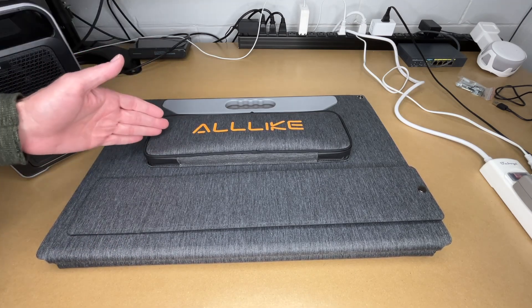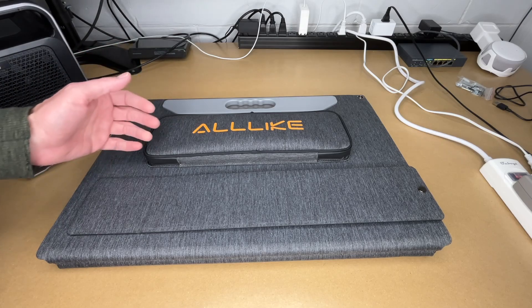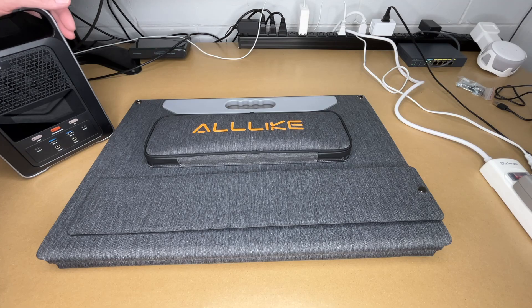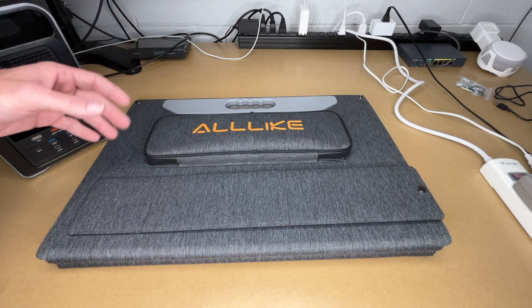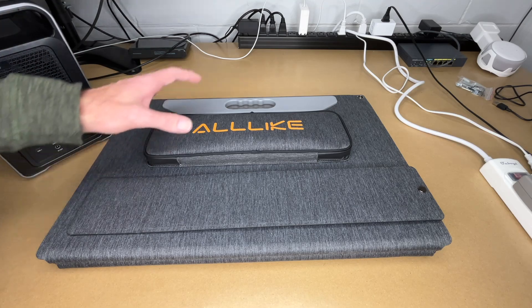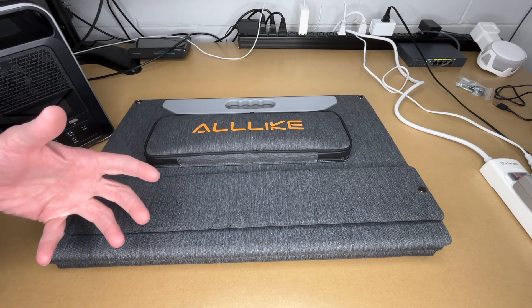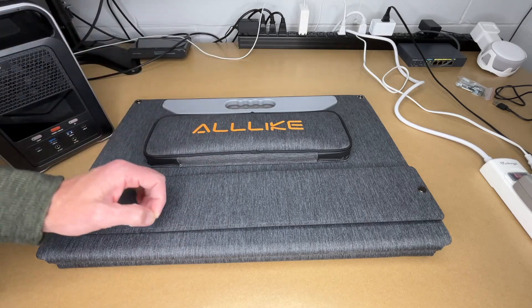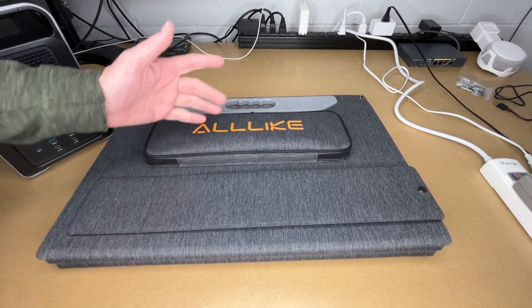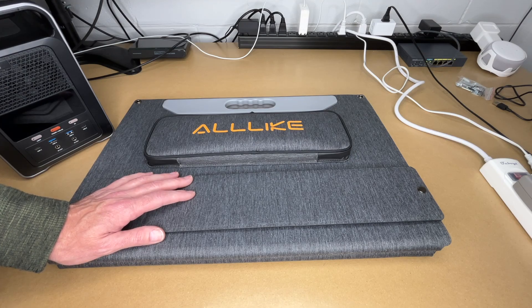The important thing to remember with this or any solar panel is that you're not going to get good output if you don't have good input — make sure it's facing the sun and aimed properly. For weekend camping, my recommendation is to make sure your power station is charged to 100 percent first. Some people think they can start at 20 percent and fill it up quickly with solar, but that's not how it works unless you have a massive solar array. With the waterproof rating you can set this up in the sun, run the cord into a tent, and not worry if it starts raining while you're hiking. Thanks for watching.